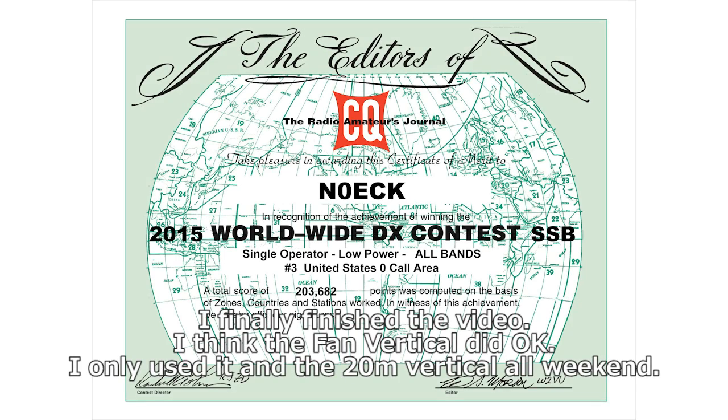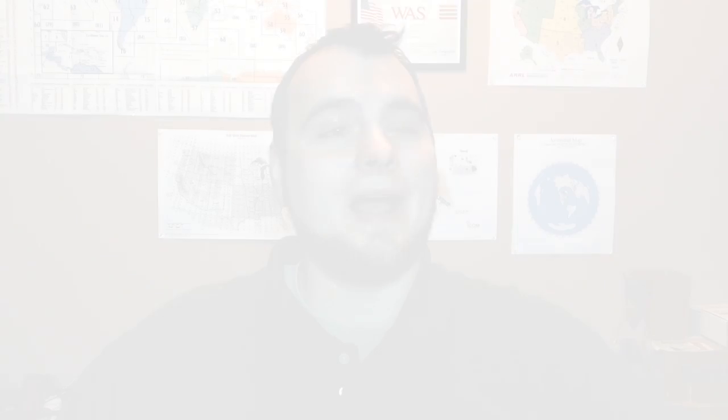The total mess of signals on 40 meters was hard to dig through, but I did a side-by-side comparison with the dipole doublet and the vertical had a better signal-to-noise ratio. The result was the same on 80 meters and I was even able to work a few stations on 160 meters that I would have missed without that wire. I worked Africa on 80 meters on that wire — I know that's one of those things we don't like to say, that working big DX on a brand new antenna means it works.